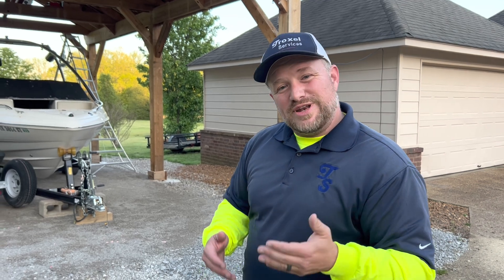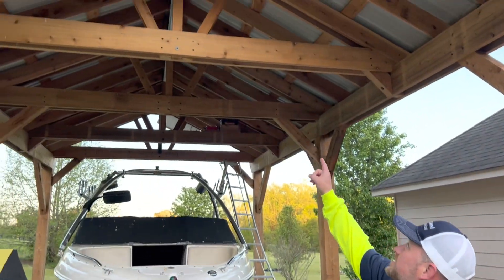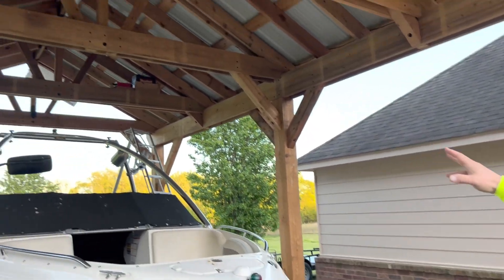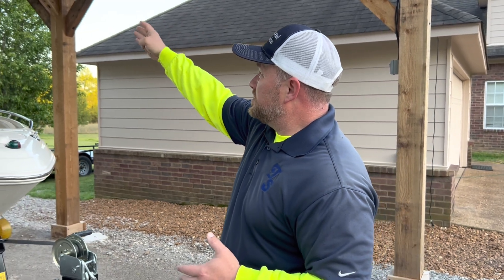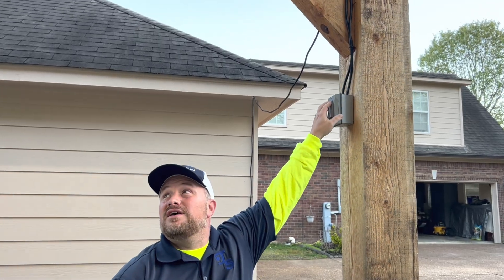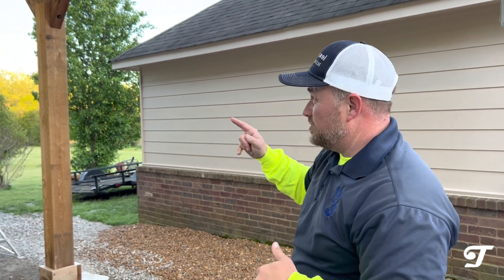Let's turn on the lights because we never did that last time. We have three shop lights in here — 5,000 lumens each — and that's powered by a solar panel you can get off Amazon for about $150, connected to a marine Duralast battery. You need a converter to go from 12 volt to 120 volt, and we ran extension cords down to an external weatherproof switch. All three lights come up — no electricity needed from the house, all solar panel driven.